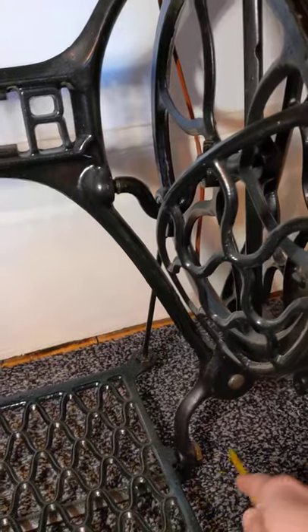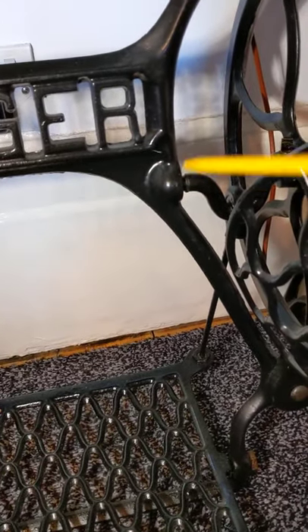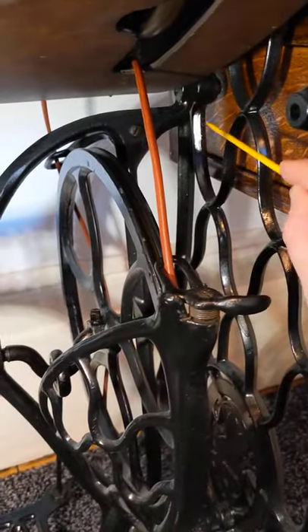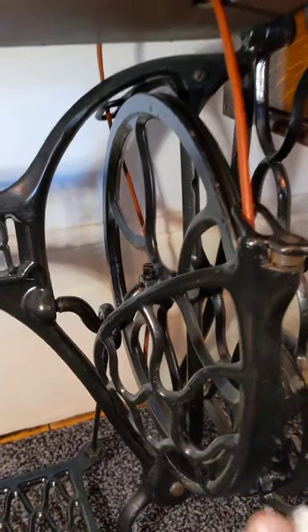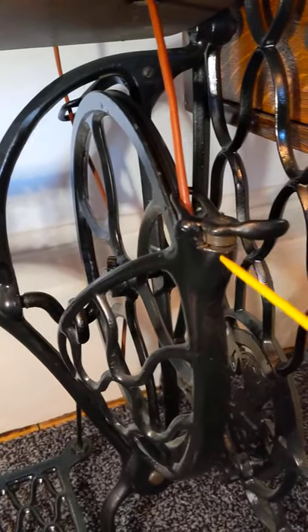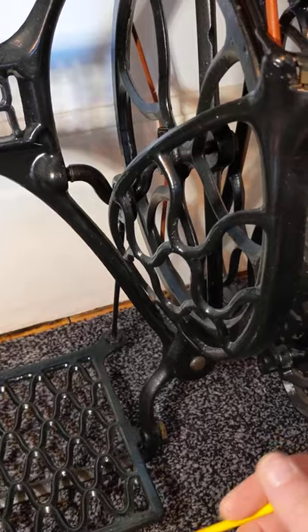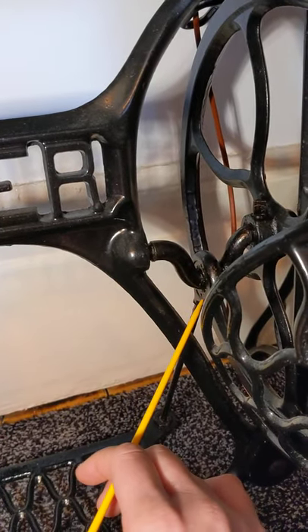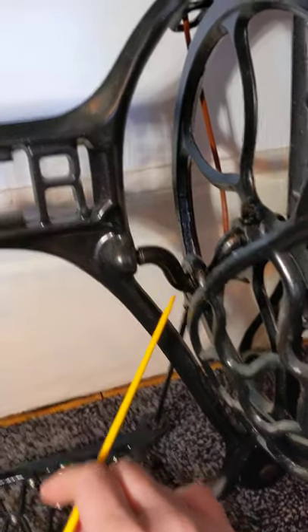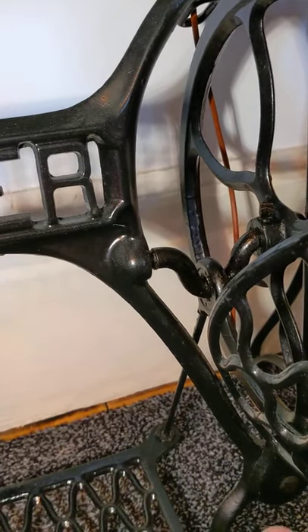If you don't grease the bearings and they heat up, they will explode or crack, and then you're going to get bits of bearing in there - tiny pieces of metal that are really horrific to try to get out. That's what happened to me. I took apart this treadle, undid the bolts on both sides, took the whole wheel mechanism apart, gave everything a good clean, and re-sprayed the whole treadle. That did mean I had to re-grease these bearings, and mine was making a funny noise - it was the bearings.